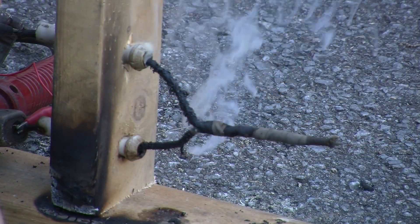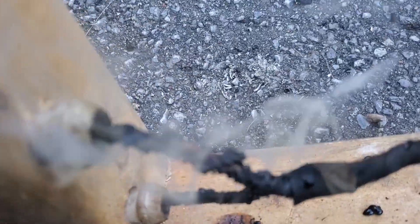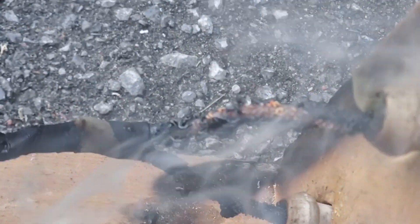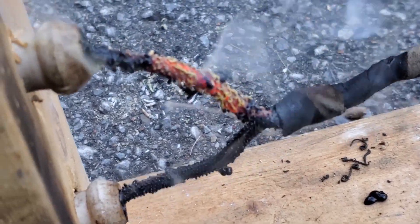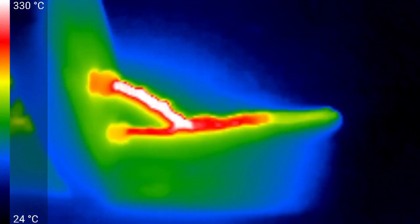The top of the insulation up here is now beginning to lose the rubber, as we saw before. I don't know if that's glowing red or not — it might just be glowing red. Actually, I correct myself: it's absolutely glowing, just like we saw before. Interestingly, the splice is doing pretty good. We should look at that with IR. That upper part is probably as hot as the camera can register. Very impressive splice, that's for sure.